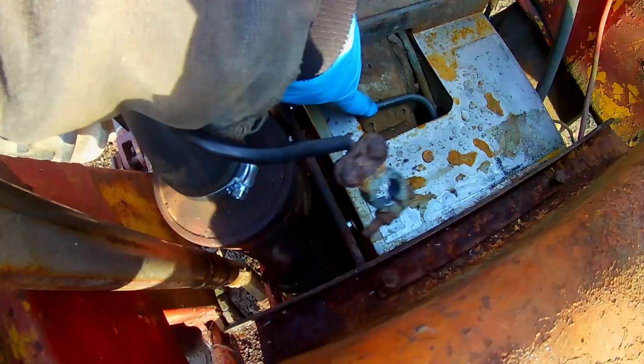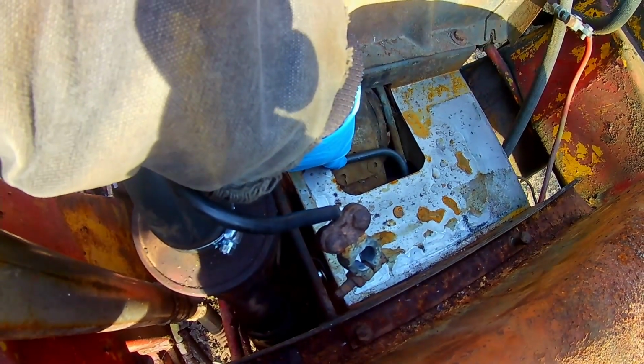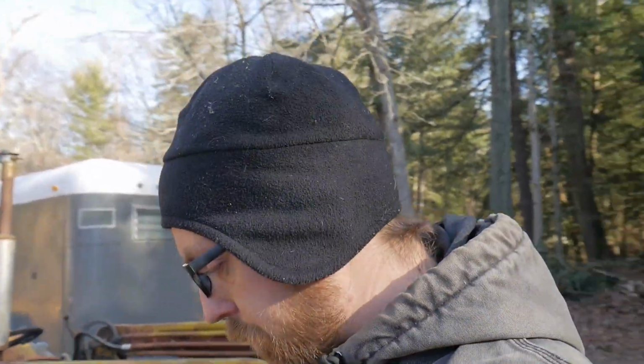We bent and made a new, it was just a 3/8 inch brake line for hydraulic line for the power steering, and that's just a double flare on each end too. I used the old fittings on it, so that wasn't a big deal.